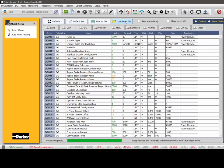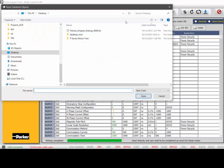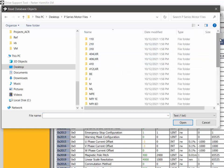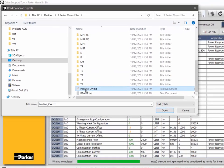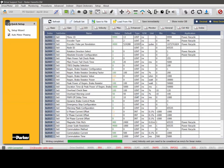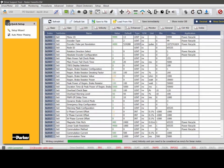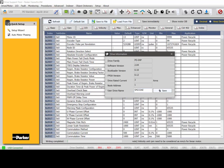Because I'm using an ACR controller, I want the direction to be positive. In the motor files, go all the way to the bottom — you can see there's a setting for clockwise as positive. After saving to memory and doing a software reset, this cycles power on the drive and will close the connection, so you may need to click to go back online. Now you can see the drive has been named based on the motor file.